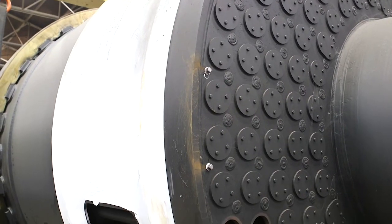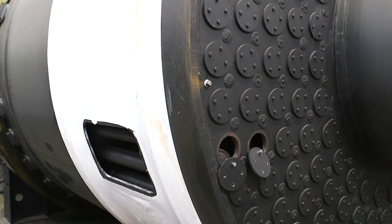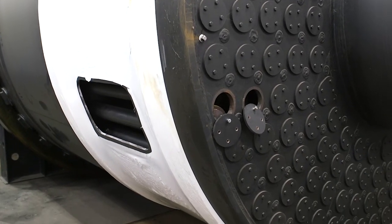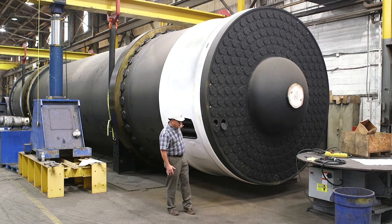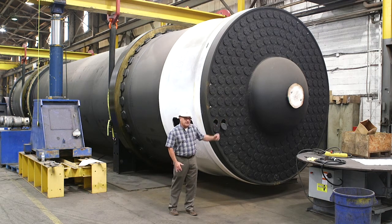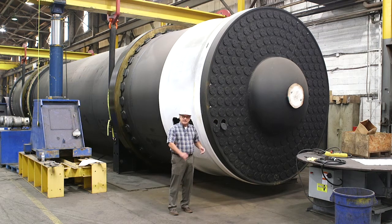It's kind of like a boiler. We've taken a couple of hand-hold covers here. The tubes tie into a sheet right here, the steam is dispersed into the tubes, and as it condenses, the condensate comes back down, it's channeled over into that sump, and it's taken back to the boiler to be resupplied back into steam.